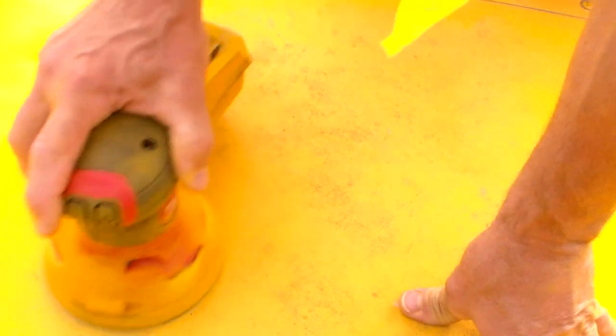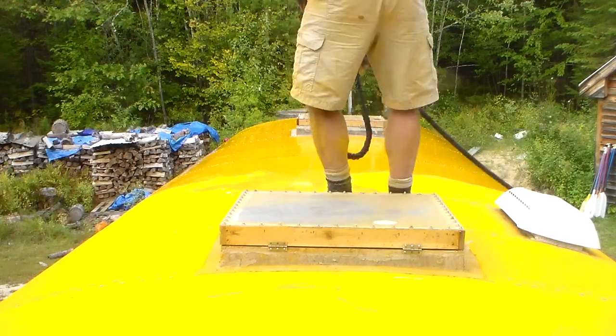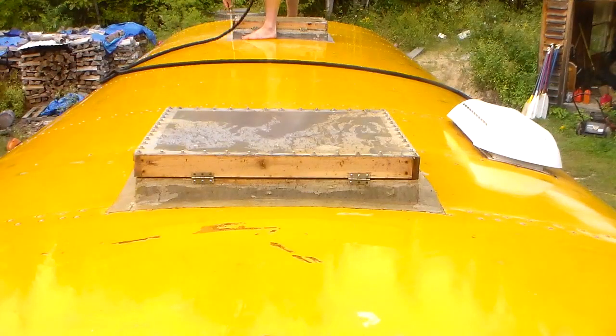It only took me a couple of hours. I used some 80 grit and went through until it was as clean as possible — no grit, no grime, and weird things that were sort of stuck on there. So I sanded it all down with 80 grit, then hosed it down, and did go through with my Scotch-Brite pads and some Simply Green. Cleaned that all up, got all the dust off, and then hosed it down again.